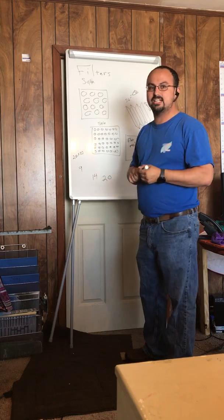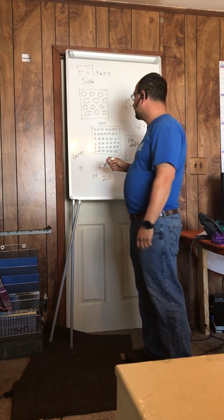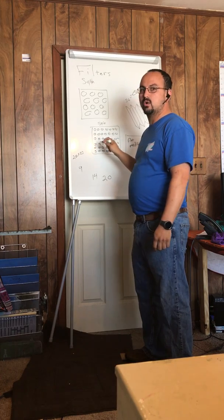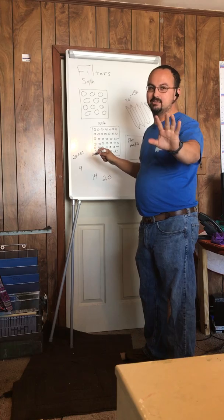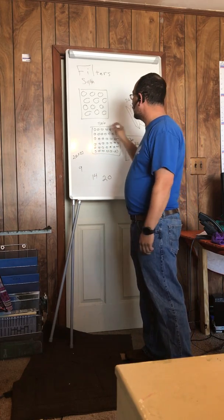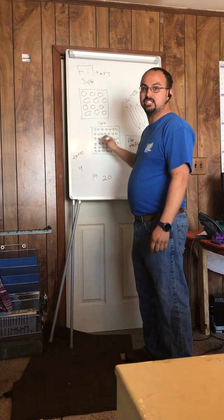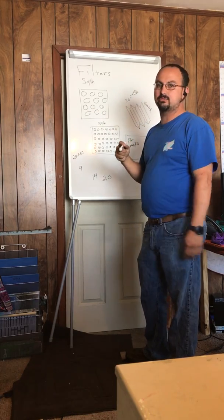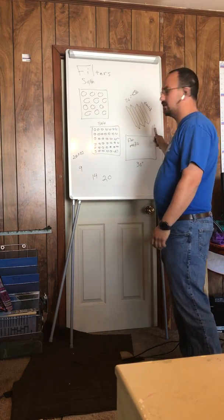Let's just say, for instance, we've got 10 1-inch holes here, then we need to have 100 1/10 inch holes here. Don't scrutinize me on the math. I just made that up. It sounds right in my head. So that we can still have 10 square inches of surface for the air to come through. So how do we do that? That's where we got the pleated filter from.